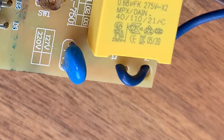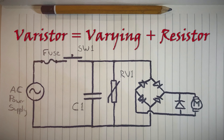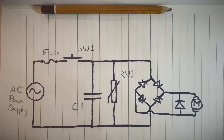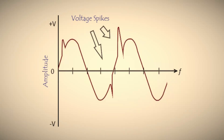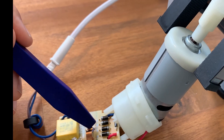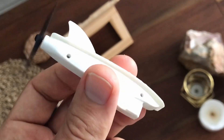Next in our list is that little blue thing, which is a varistor — a variable resistor whose resistance depends on the applied voltage. The name itself is a linguistic blend of 'variable' and 'resistor.' It is safe to say that a varistor is a voltage-dependent resistor where resistance changes automatically with a change in applied voltage. Unlike the capacitor, it's not so much about the frequency but all about the voltage itself. When circuits experience higher transient voltage — greater than the so-called clamping voltage — current increases and the varistor acts as a conductor, suppressing the voltage transients to ground. So that was a little overview of the DC motor control circuit, and that pretty much concludes our video about DC motor applications. I hope you find it useful, and I'll see you next time. Bye.